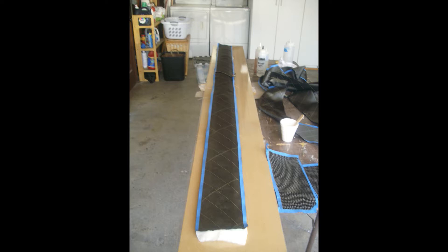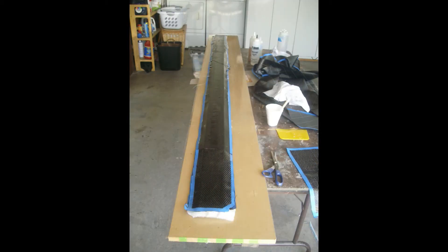Currently I'm using Poly-epoxy from Aircraft Spruce. It has superior mechanical properties while still being reasonably affordable. It cures enough overnight to remove the parts and achieves full strength in 7 to 10 days. It is an extremely stiff epoxy which is needed for this type of aircraft. Although it's difficult to see, look for the diagonal cut tape on the corner.